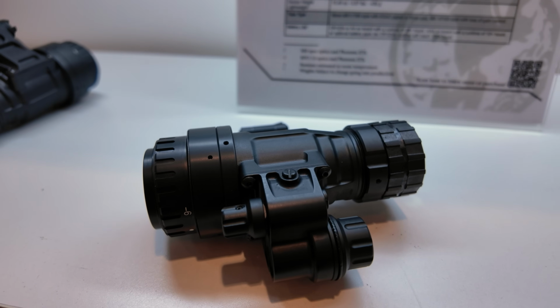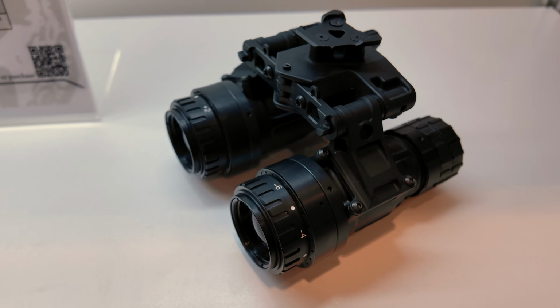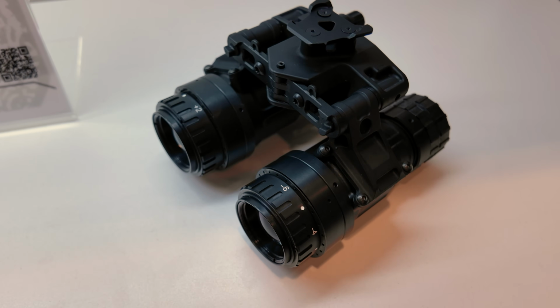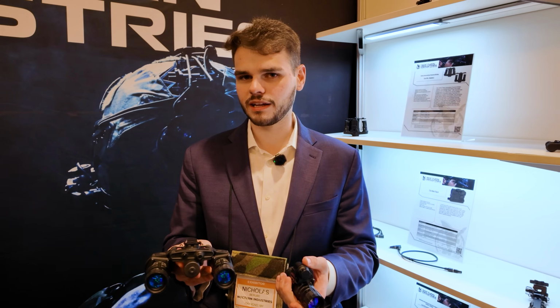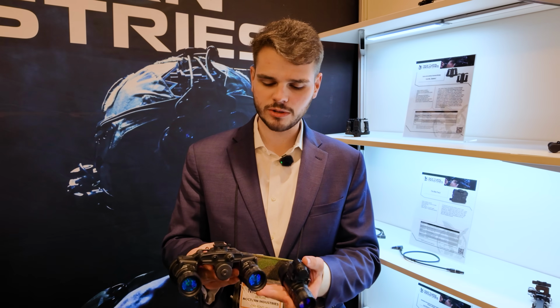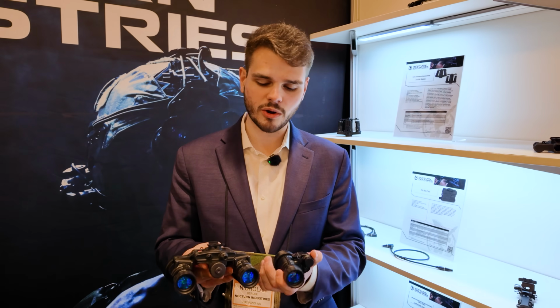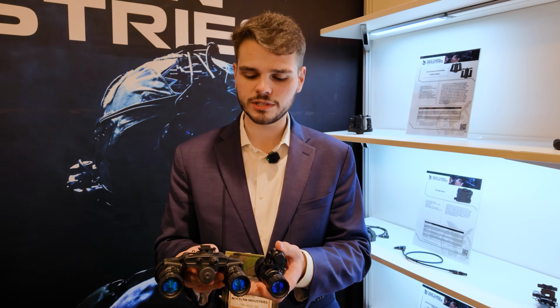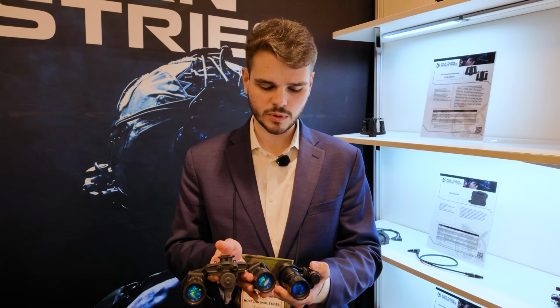Going between these two systems here, the Raptor and the Talon monocular, basically in order to interface between the two, the lower pod takes 4 screws. Simply unscrew them, unplug your EGAC or plug it back in, close it up, tighten your 4 screws, and you're good to go. Just to note that going between the two systems, you will lose purge. I would highly recommend you have a dealer or somebody mechanically inclined doing that swap, or at least somebody knowledgeable in the systems.